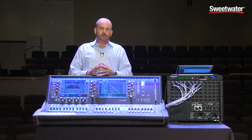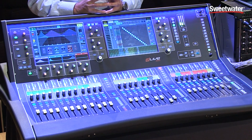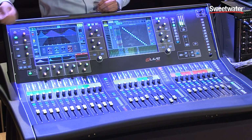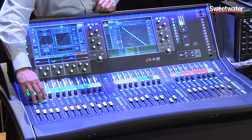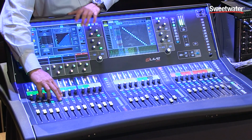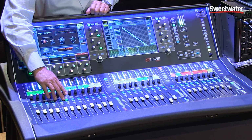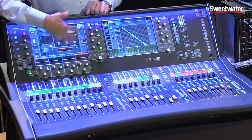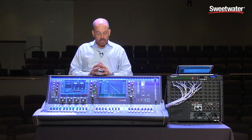One of the things that we've been doing with our engineers, using the power and the core of this new FPGA processing on board, is creating our own internal embedded plugins. So embedded within the core of the actual channel strips, we have multiple different types of compressors. We have a new vintage optical style compressor. We have RMS and peak, as well as an 1176 style compressor, standardized the 16T compressor style, complete with full adjustment controls. They have gain reduction meters on them, and that's on a per channel basis.